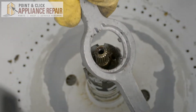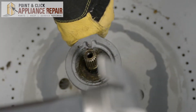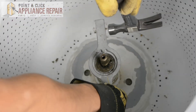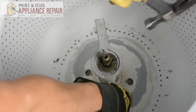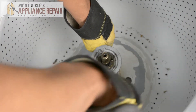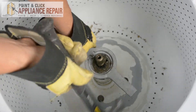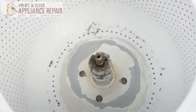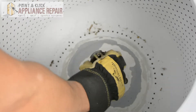We're going to get our spanner wrench. We've got four little notches that'll line up with the holes there. We've got a hammer because it's going to be tight and you're not going to be able to get it by hand. So we're going to take the hammer and just tap it a couple of times to loosen it — we're going to go counterclockwise. Now that we've got it loosened, we can just undo the rest by hand and pull that right out.